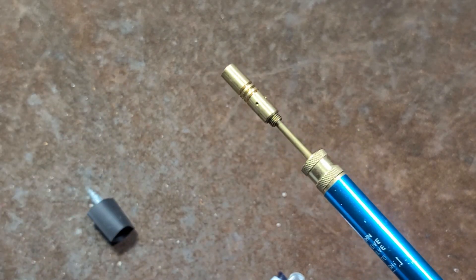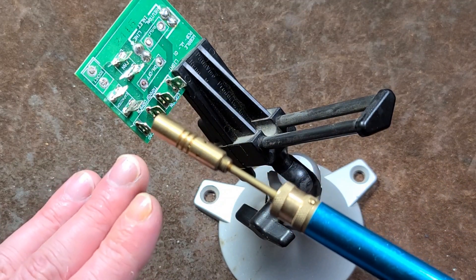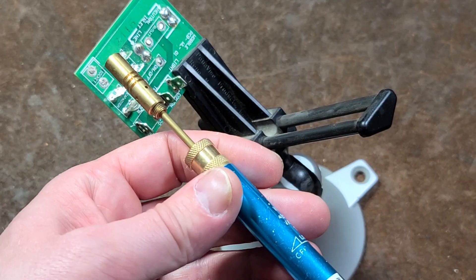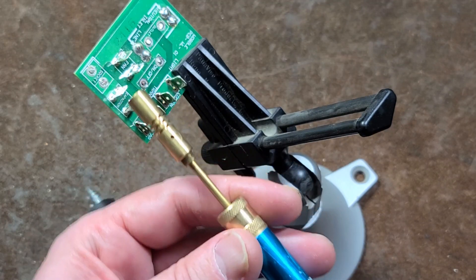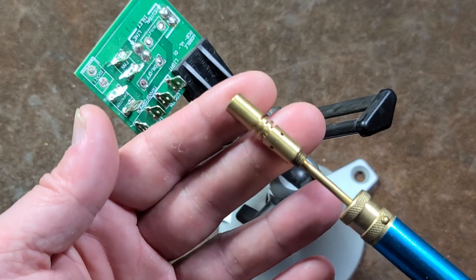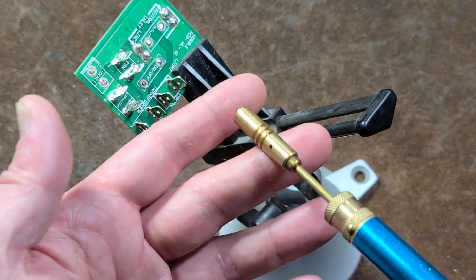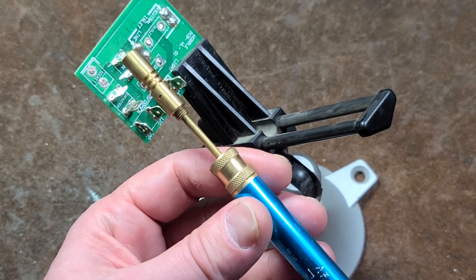They can be used for shrink tubing situations, or maybe for very small copper tubing used in air conditioning systems. I wouldn't really say for brazing. If you're working on heavy gauge wires and trying to solder, many times you'll need a 200-watt plug-in soldering iron, and even then, because soldering irons rely on physical contact, you just can't deliver the heat very well. So these can be very good for industrial-sized soldering — if you're soldering welding cables, this will allow you to get enough heat without being quite as bulky as a rosebud torch.